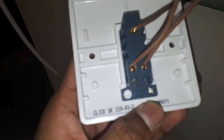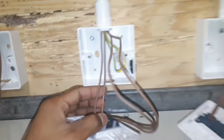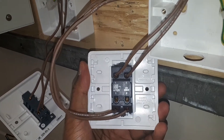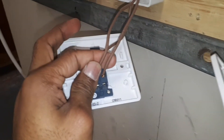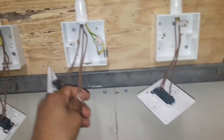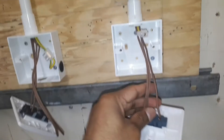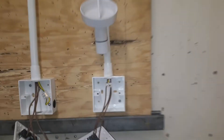After that, I took two cables — one brown cable goes to line one and one goes to line two. From the first switch to the intermediate switch I ran these two cables, bringing line one and line two into the intermediate switch.